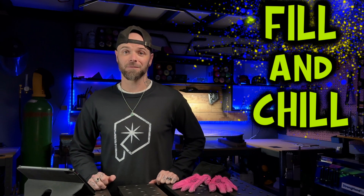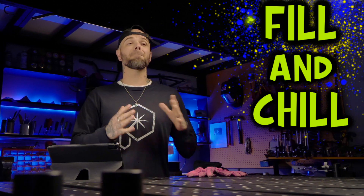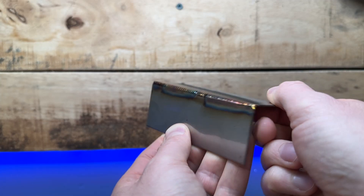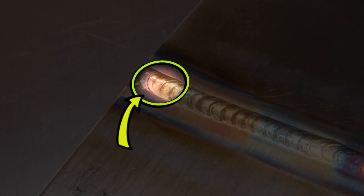What do we call this on my channel here? If you're feeling brave, pause the video and put the answer in the comments below. The thinking behind the start, no matter which joint you are doing — when you flash up your arc to start your pass — we are going to fill and chill. Giving things a little bit of extra filler right off the bat is going to buy you a few extra seconds to hang out and let things establish. A little bit of filler and a little bit of extra time to allow things to stabilize. The philosophy I teach is that all of the important work is done at the start — once we start moving away, all we have left to do is babysit what we started.